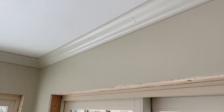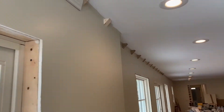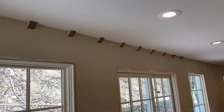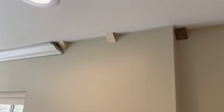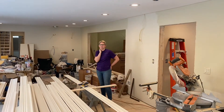I left the last few feet loose — didn't nail it up yet. There's a little bit of a hump in the ceiling where there was a drywall seam, but you won't even see that once we get the caulk along the top and bottom. And we got a nice tight joint on this end — got a good cope there. So we're working right now, we just got these nailers up along this part of the ceiling. We're going to go ahead and do a full piece across here, 15 to 16 feet, whatever we got, and then do this piece right here. I'm going to put the cope joint on it, put it together, and that will help us set the angle so we get a good tight fit in that corner. Sound like a plan? Sounds great.